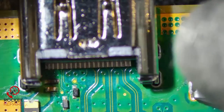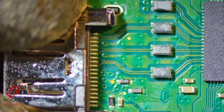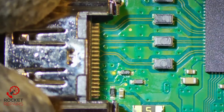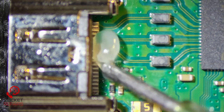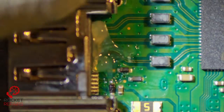And because of these ports, I am going to have to just move this over and hold it in place whilst I solder it down just here. And I really have to push on this because otherwise, if I leave it, look, you can see it's dead in the center of all the pads. So what I'm going to have to do is pre-tin my soldering iron and flux down. And we are going to have bridges, but we're going to sort them pretty much straight away.